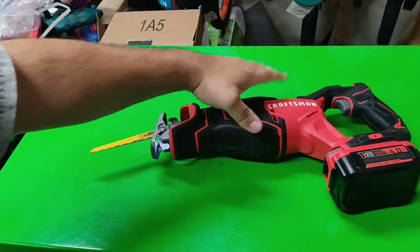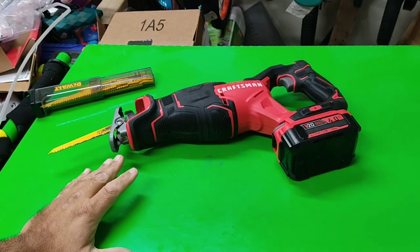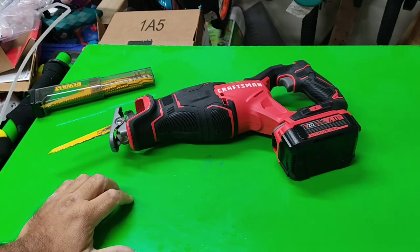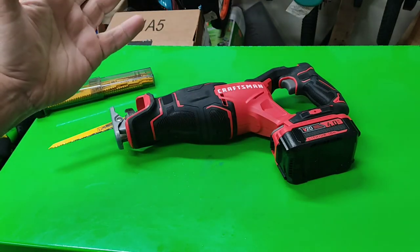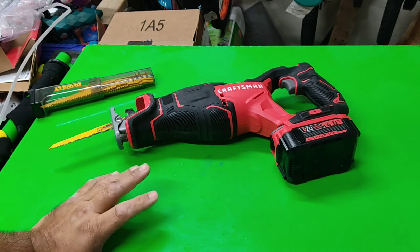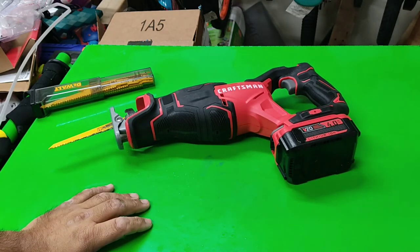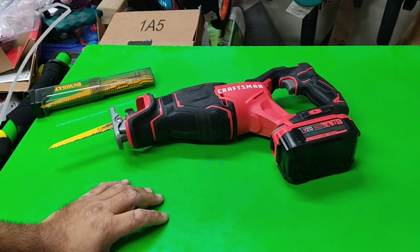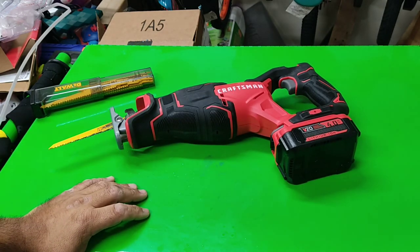Awesome. Brushless — I'm trying to upgrade as many of my tools to brushless as I can. I sure wasn't getting the brushed version since I already have a brushed corded, a brushed cordless, and the brushed matrix one. Nice little addition to my collection. If you're just starting on tools, just go with brushless. If you have a bunch of brushed tools and you're itching for a new tool and already have something, do what I do to help with the wife — say you're upgrading to brushless, and it is an upgrade. You don't have to worry about brushes burning up or anything like that. The only thing you really have to worry about in the motor housing is airflow and ball bearings. Because brushes on electric motors are always the first to go out — they should last a lot longer than a brushed motor.